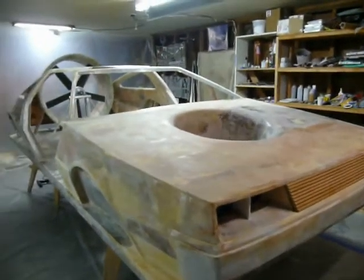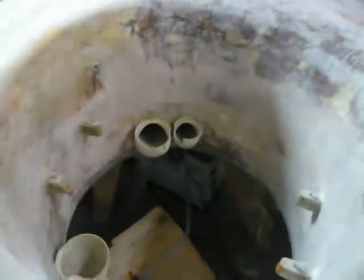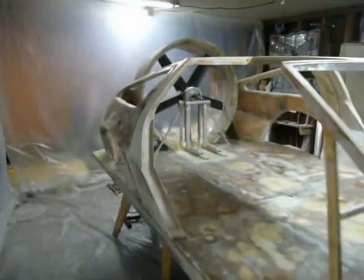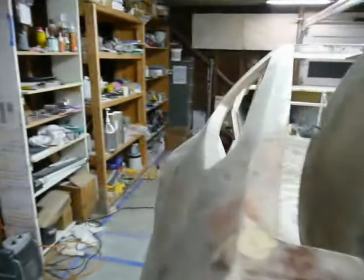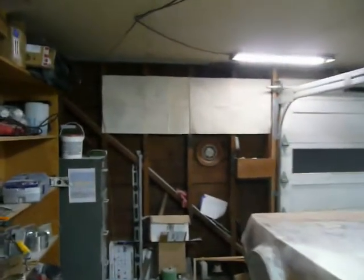There she is. If you're unfamiliar with hovercrafts, all you need to know is that there's going to be a fan in here that shoots air down underneath the craft and lifts it a few inches off the ground. And then this fan in the back pushes it forward. And there's going to be three rudders behind this fan to turn it. Even though it weighs over 400 pounds, when it's hovering, you can easily grab it with one hand and move it back and forth because it's frictionless. Here are the blueprints I've been using from a company called Universal Hovercraft. As you can see, I've made a few modifications, but it's coming along nicely.